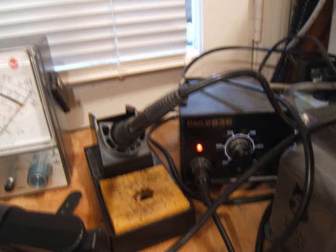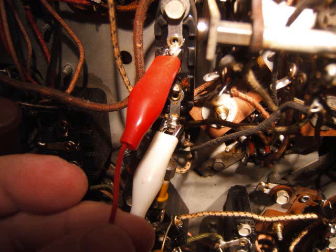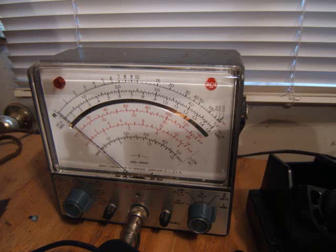I'm firing up the soldering iron and getting it ready. I got my volt ohm meter working again — I had a little problem with it. It's on the high megaohm scale and it's at infinity. When I hook up the leads to test the capacitor, the volt ohm meter goes to zero. I tried different scales too, and it's a dead short.